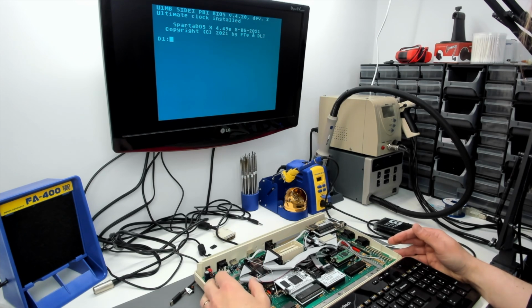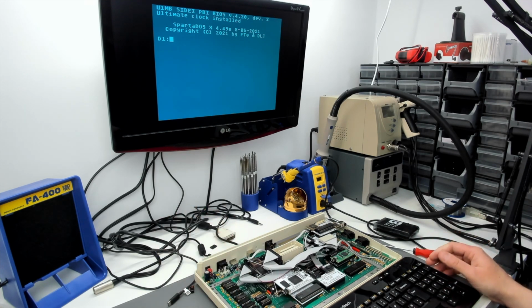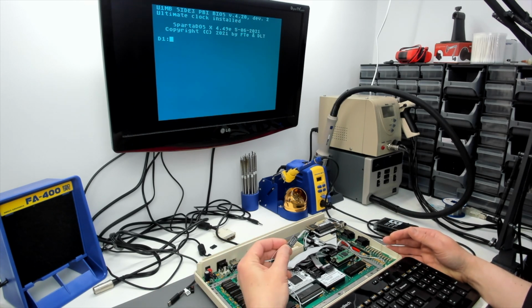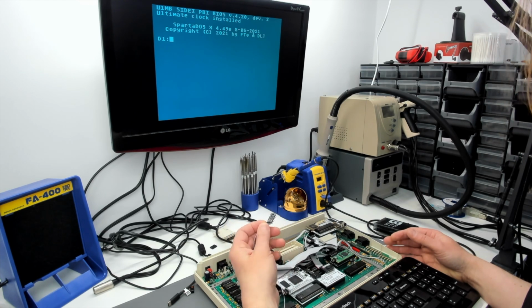So if timing glitches with SIDE3 and Rapidus can be addressed satisfactorily with a $2 chip, which certainly seems to be the case here and has been the case in my experience, the question then becomes, why do I need the O2 Fixer? And the insinuation now seems to be that it'll fix the reset issue, but only on some XLs and on XE machines, since we can already see here that it doesn't fix the reset issue on these two XL machines. I'm far more concerned by customers being encouraged to spend money on add-ons that they don't need or which simply don't work than I am by any unresolved quirks with the Rapidus hardware.